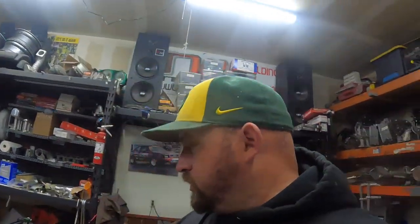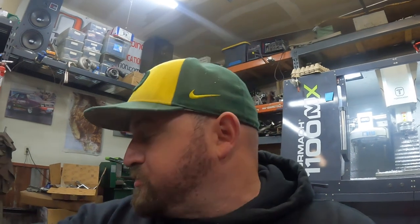There you go. So, no weld porn, just making race car parts. They're gonna work, so I don't worry about all that crazy welding stuff that everybody's worried about on the internet. Just weld it. I had that up at 230 amps. I was probably 3/4 pedal. I like to run hot and not use all my power. That way, if I need some, I can step on it and generate some heat.